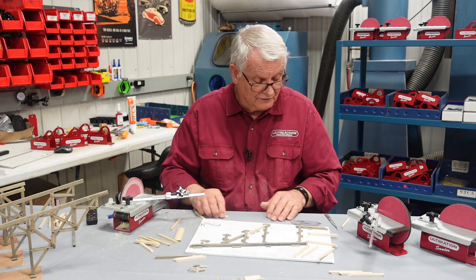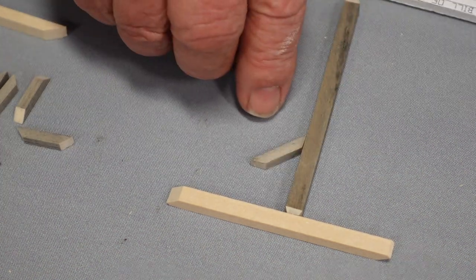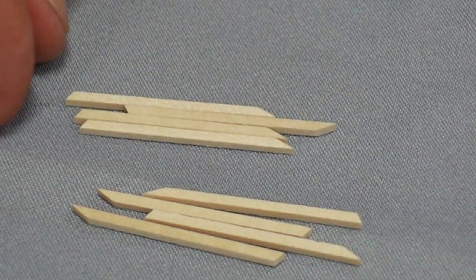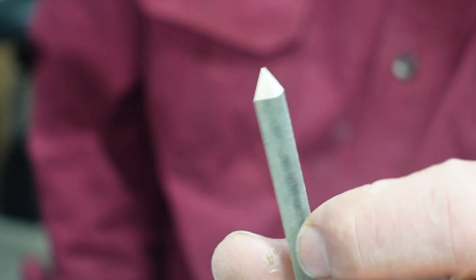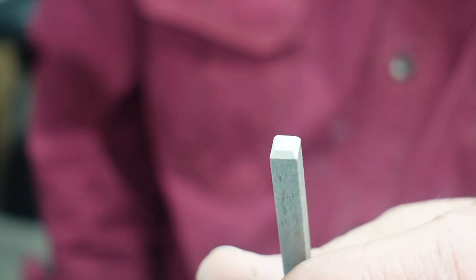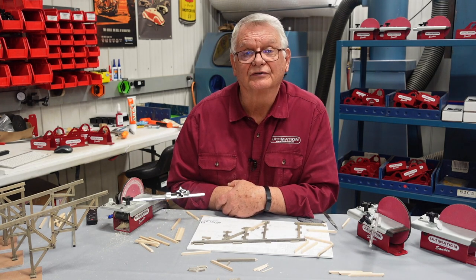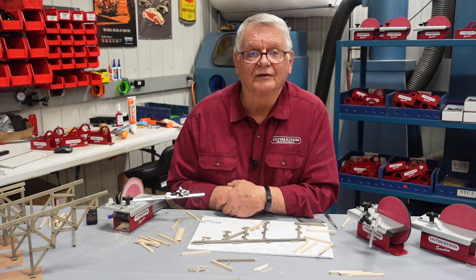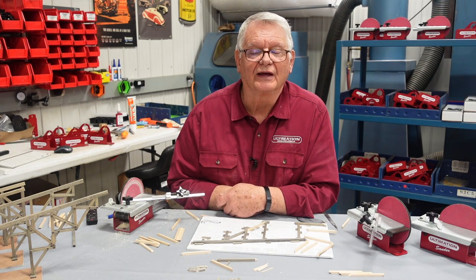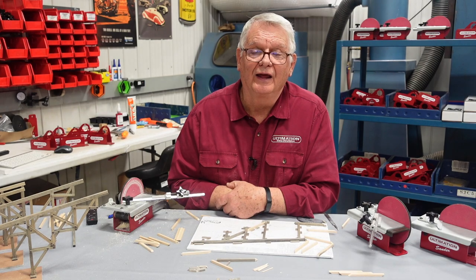There are numerous things you can do with this little attachment. You can do small pieces — like braces for timbers, or smaller tiny pieces like cross bracing for a narrow gauge boxcar. Simply by rotating every flat you can get a nice straight point, even a nice chamfer. The beauty is that it's accurate within half a degree, a couple thousandths of an inch, and it's repeatable accuracy. Thanks for watching. Stay tuned — I think next time I'll actually help a friend of mine build a big trestle, and we'll go through actually building a trestle. Thanks again.